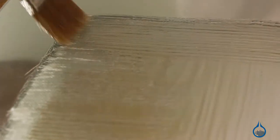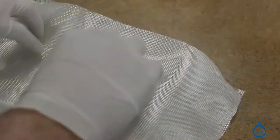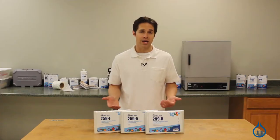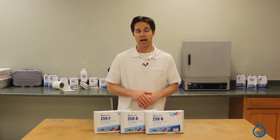It's a popular choice in the mid-weight category, and fabricators often use just two to three layers to make lighter molded parts or repairs. Plain weave construction allows uniform strength in both horizontal and vertical directions. To strengthen parts and repairs, ply should be added at 45 degree angles within the layup.